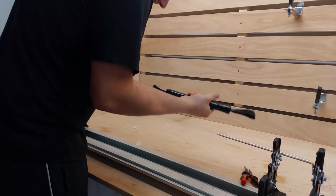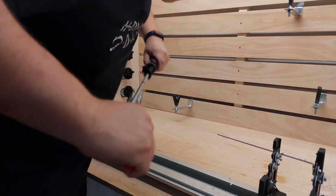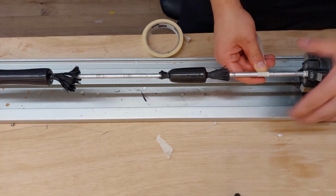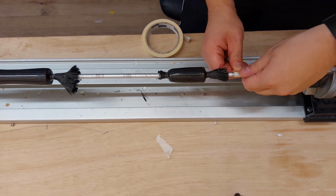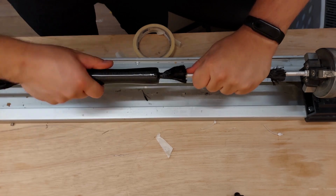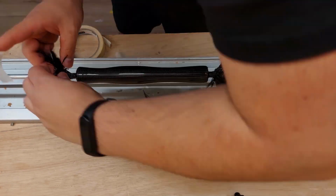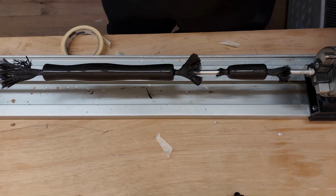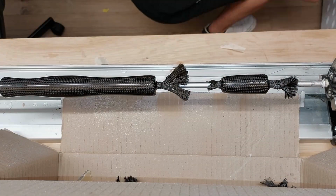After 48 hours, the epoxy is now cured completely and it is time for the next step, which is to sand the grip in preparation for the third coat of epoxy. In order to do that, I have to put the grips on a mandrel once again and secure them by placing some tape underneath the grips, so when I start sanding they will be stable.